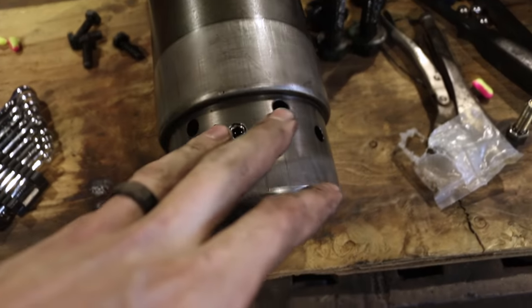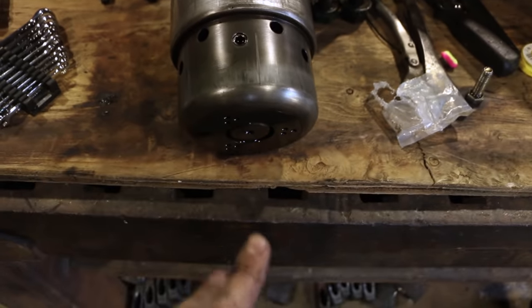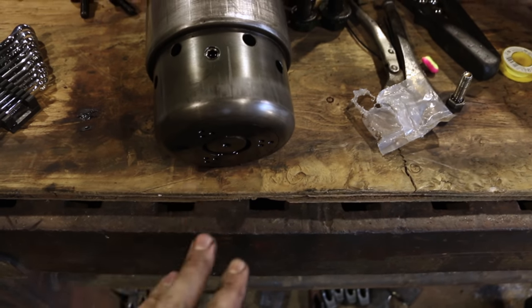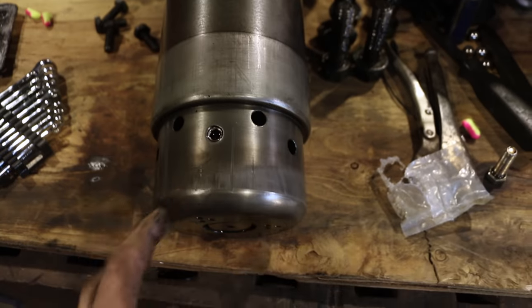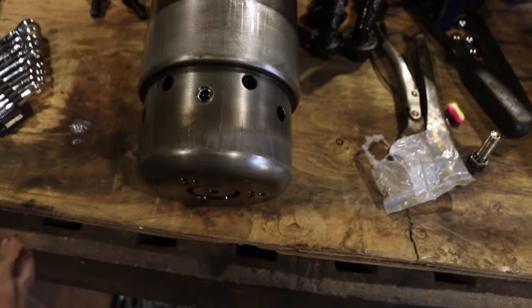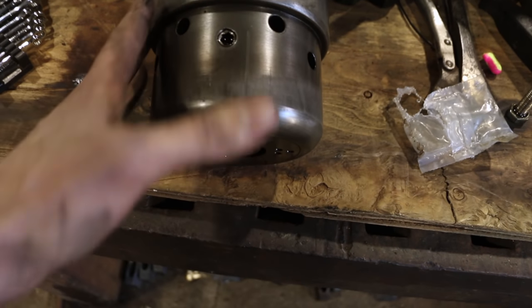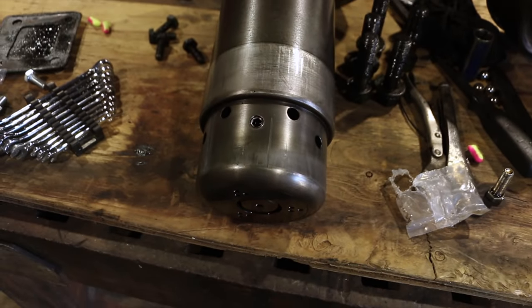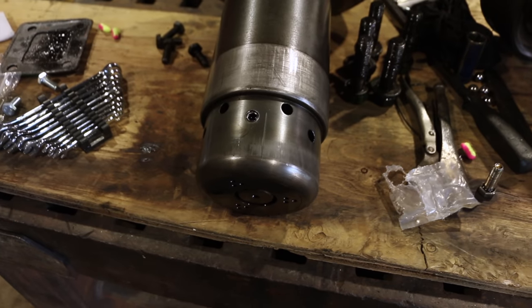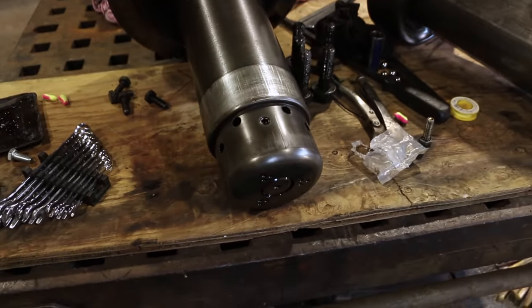This is fascinating that Bechet has done it different than Nazel, where we had all that drama with the cushion plug and the pin and everything running true. The way they've done it is no rings, and basically from roughly understanding it, as the ram comes up, it closes this gap off, and then the air is forced through these ports and check valves to cushion it. And I think that's going to be a system that allows for a lot more wear and slop in the hammer to still perform well. So kudos to Bechet. I think that's a good system.